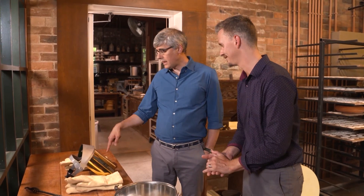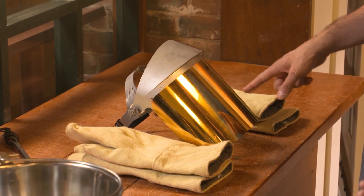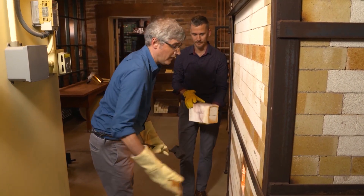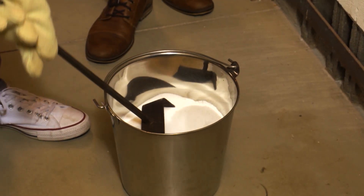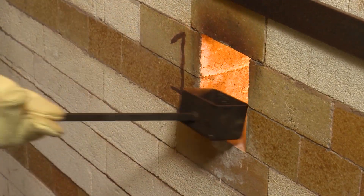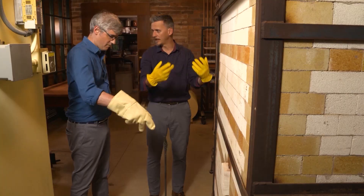Obviously, adding salt to a 2,300-degree oven requires special equipment like Kevlar gloves and a heat shield. Our demonstration is for show only — if this were for real, there would be a lot of heat and a large flame coming out of there. Go ahead and scoop, then turn and dump. Then we would replace the brick as quickly as we can and let it vaporize.